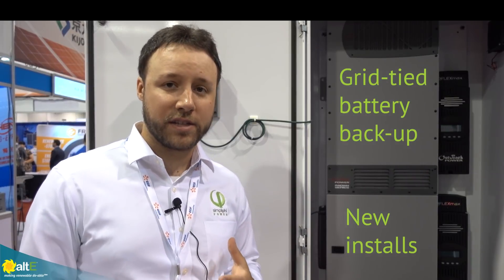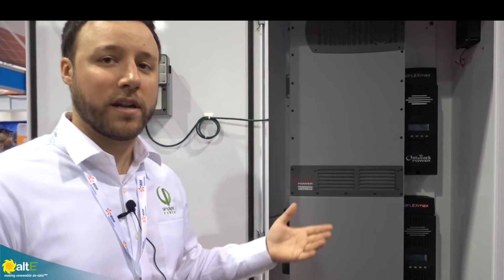The unit is plug and play, pre-programmed, pre-wired, and also comes in a NEMA 3R enclosure. So this enclosure is outdoor ready — no need to install inside. This can just be delivered already wired. You put the batteries in, connect them. This unit can be used for an array of things: battery backup, putting in a new PV system, using this for an outdoor installation. For more technical features, we can use things like peak load shave, time of use — tons of different functions. Easy to do install; the only thing needed is the solar or any type of renewable energy that can run into the charge controllers.